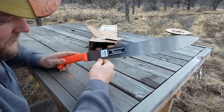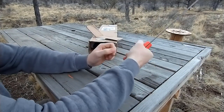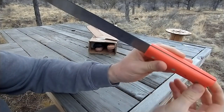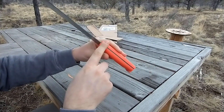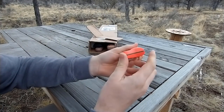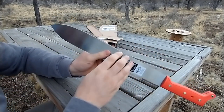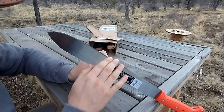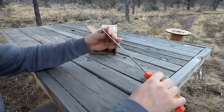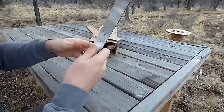Definitely made in Colombia, which is kind of cool. The handle isn't too bad. Look at the mating surfaces — right here it's flush, but down here you've got maybe a 16th of an inch gap and those dig into you when you're swinging. The edge on this is rounded — I can feel a giant burr. They probably ground this with a super rough grit. Look at this side — it is so bad.